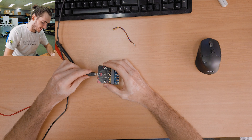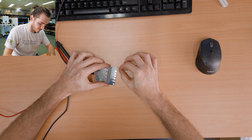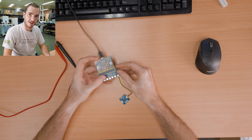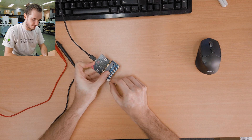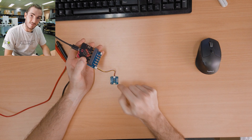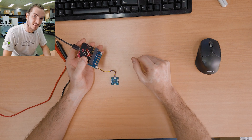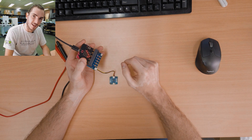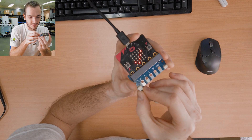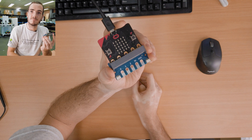The other component is to plug in a real PicoDev module. This micro:bit is running some code, and if I just plug this PicoDev module in we should get a little tick displaying on the micro:bit. I can plug that in on one side, plug it in on the other. The micro:bit is looking for a valid I2C address and then a sensible temperature reading from the sensor to make sure that communications on these plugs is working as it ought to. When I plug it in we get the tick, and I pull it out the screen goes blank again. We just check both sides.